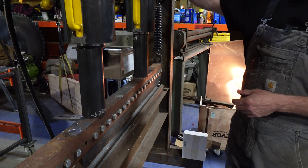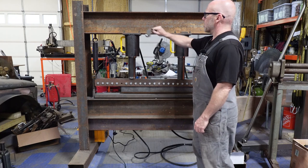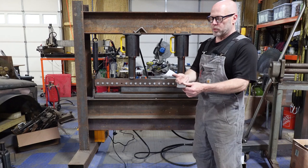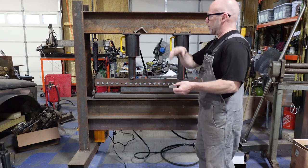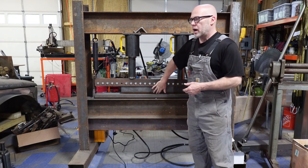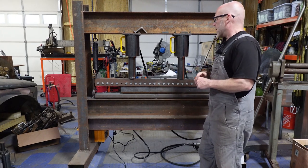All right, let's go ahead and reposition, and we're going to talk about some of the pluses and minuses of this design here. Okay, here we are. So we've got enough power to bend our 5/16, and that did a pretty good job. We saw when we stepped up to the half inch that caused a failure of the material. A more radius die instead of that sharp tooth would have allowed this to bend in a normal curve. There's a minimum radius for bending things. You can look it up. So there's that. It did cause a little damage to one of the fingers where we bent the half inch. It rounded the edge of it. So I'll have to put all them in the mill and probably replane them all in the same orientation again. So there's that.